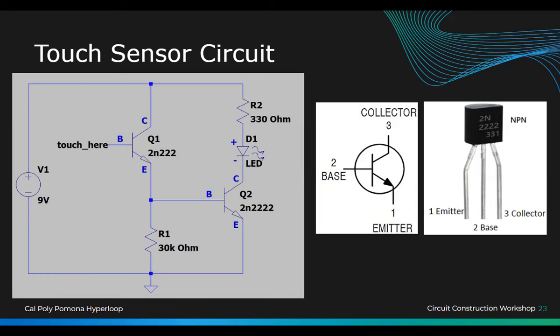All right, I'm going to teach you guys something real quick. So these resistors are super long, right? So this is where this piece comes in. What you're going to do is face it the way where it's a CPP, and then get your resistor and put it in the top one like this, and bend it. So then it goes like that. Right? So it goes through like this. And then you use your wire clippers and cut it. So it makes a perfect size for your resistor on your breadboard. So that's what these are for. Okay. All right, go back to racing.